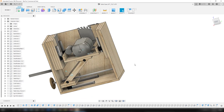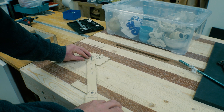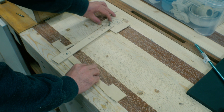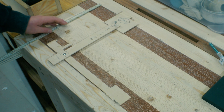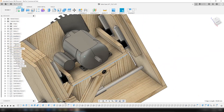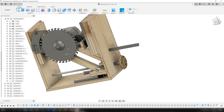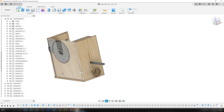Here we have the lift mechanism. To figure out the height of the lifting levers, I had to make mock-ups out of 3mm plywood to determine how long the levers needed to be for maximum cutting depth when the blade is at the top position. The mounted rails are down here, and the motor sled also rides on mounted rails on the side, so the sled only moves back and forth and the motor sled only moves up and down. I realized there will be a lot of dust in here, so I made a dust guard or dust cover, and I will also have a dust extraction system with a 100mm (4 inch) hose in the back.